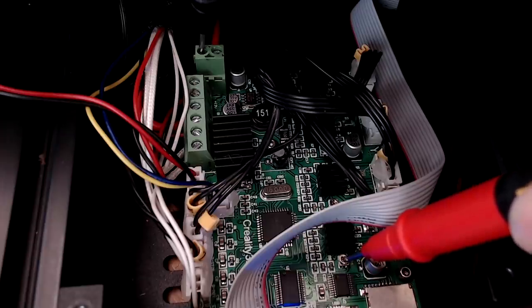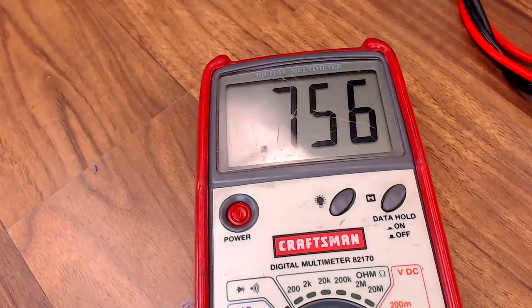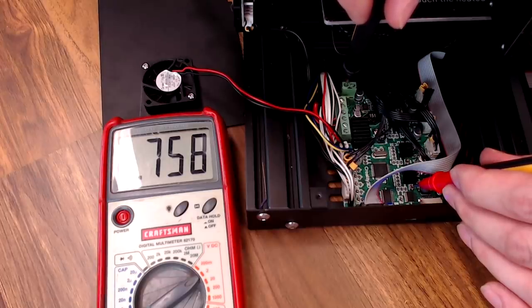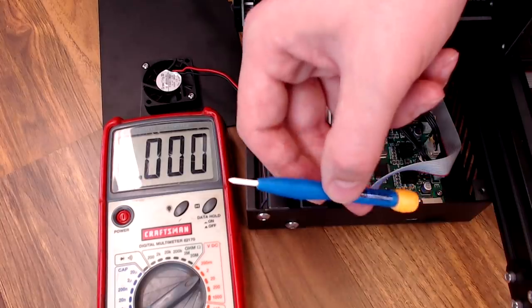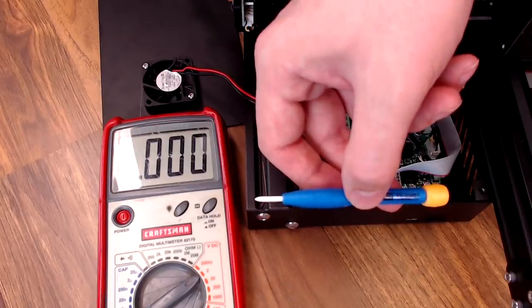Be careful - you do have to have the power on, and you don't want to short anything out. You at least need USB power to check this reference voltage. For a starting point on most 3D printers with NEMA 17 motors, I like to start anywhere between 700 and 800 millivolts. If you're seeing issues with skipping, you might want to turn it up a bit. If the driver or motor is getting too hot, turn it down. If you need to change the reference voltage, I highly recommend using a ceramic screwdriver so you don't short anything out.